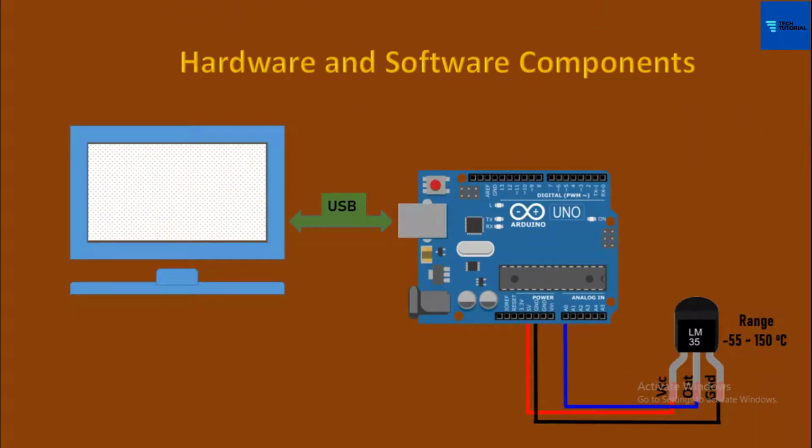Now for interfacing the Arduino with the PC-based SCADA user interface, it is mandatory to run the Arduino OPC server on the PC Windows system with proper configuration and settings, so that this Arduino OPC server will communicate with the Arduino and be able to read the sensor data from the Arduino in OPC format and provide this OPC data to any OPC compliant SCADA user interface. Last of all, select an OPC compliant SCADA software and create a user-friendly SCADA HMI using it.